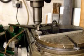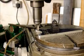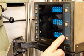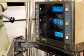I've got my tea here. Jeff's now just getting that lined up. It's just starting to scuff there. Hang on, I'll just show you that. We've got the DRO, setting that up. Then we zero it. Yeah, and we'll take 2 mil off it.